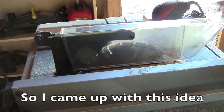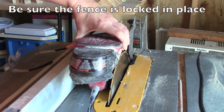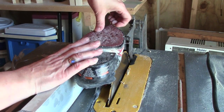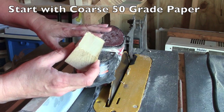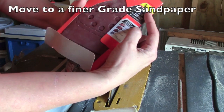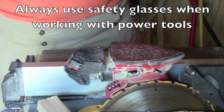Here's a cleverer way to make sanding a little bit easier. I'm using my table saw and my mouse sander — placing the sander upside down, and this bar over here will hold it. Now I'm using a coarse paper to get all the really rough edges off. After going over them with 50-grit — very coarse — to get the rough stuff off, I can go from 80 to 120 to 220. The bigger the number, the finer the sand. But I start with the coarse. Put on safety glasses to protect the eyes.